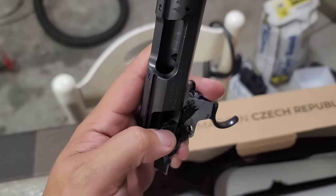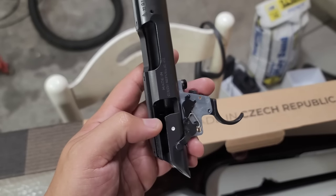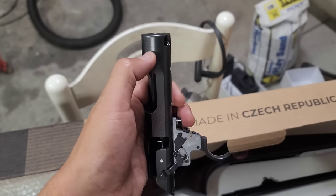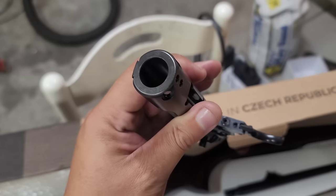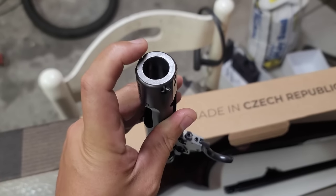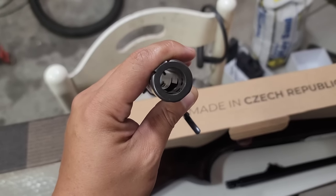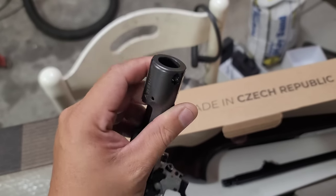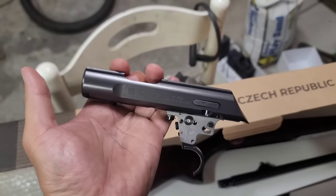There are a lot of CZ457s out there with different tenon lengths and different headspace lengths, and the reason is wear and tear on the bolt lockup area. Any wear and tear there causes the bolt to fall back further, enlarging the headspace. Another measurement I've noted: out of 23 actions I've measured, the inside diameter of the receivers was tapered — not a uniform diameter inside — which makes it really hard to build a barrel to fit exactly how I want with the proper engagement I consider a rigid design.